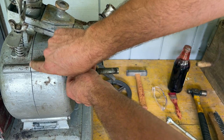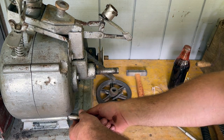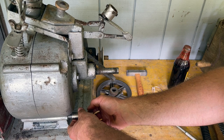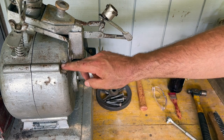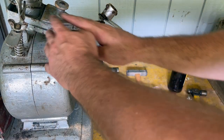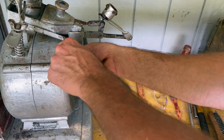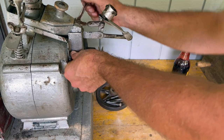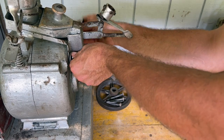You can see how the case is splitting open right here - a crack forming there where it's separating. Traditionally millstones lay flat, one flat on top of the other, bed stone on the bottom and runner stone on top. About 1900 or 1902, WC Meadows invented these mills with the stones standing vertical, side by side. You don't have to take the hopper and the shoe assembly off, but I'm going to just to make things easier - it'll make life a lot easier dressing these stones, taking everything apart and putting it back together.